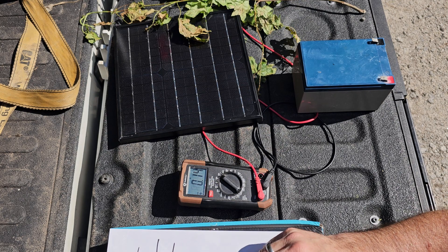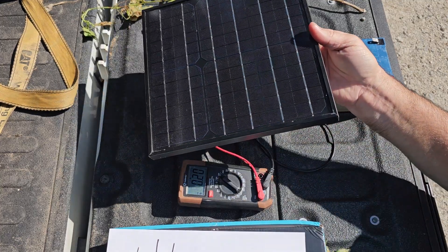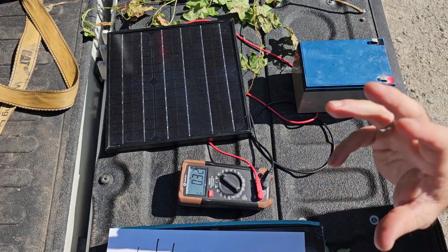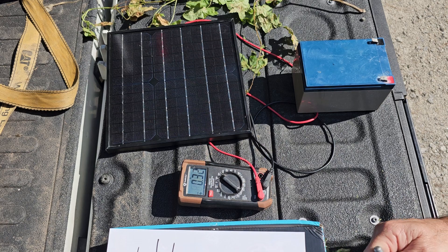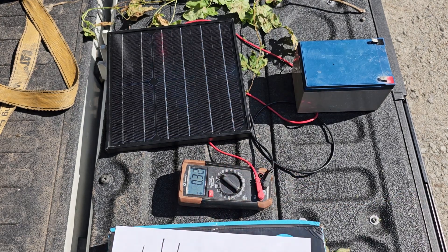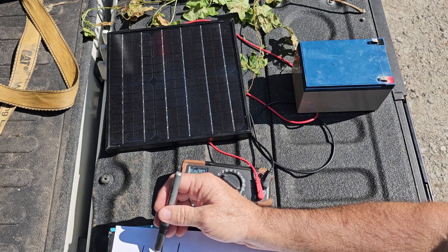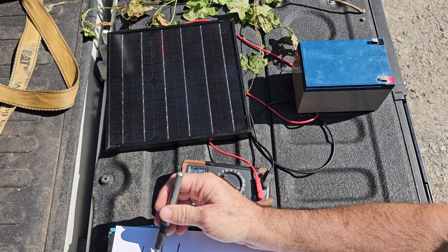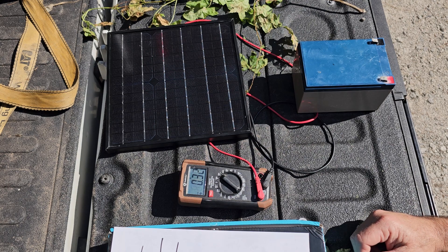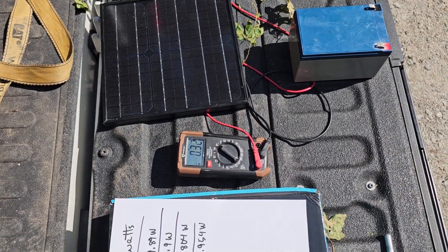So partial shade brought a 10 watt panel down to about a 3 watt panel. Partial shade at an angle: less than a watt. Full sun at an angle: just shy of 4 watts. Full sun direct: 9.89 watts at 4:30 in the afternoon. That's why solar farms have motors so the panels track the sun to stay most efficient - and they don't have any trees on a solar farm either. In the middle of the day it'll show close to 11 watts.